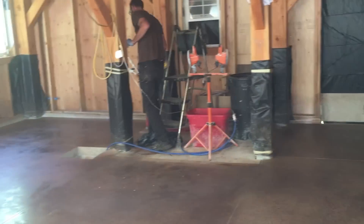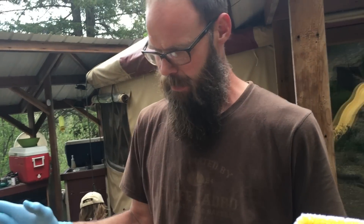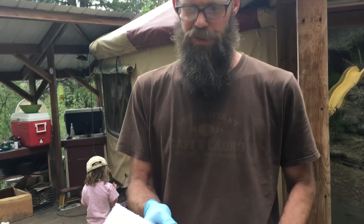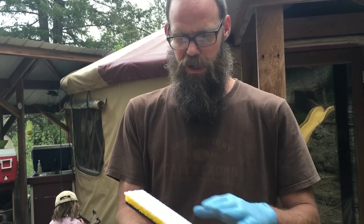I don't think I'm affecting the look necessarily; I just think that was a frustrating process. The second coat gets smoothed out with a paint pad or the T-bar applicator, which is like a big lamb's wool thing. I'm just using the paint pad. I get it wet so that it doesn't just drink up the material.